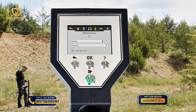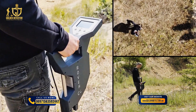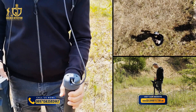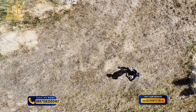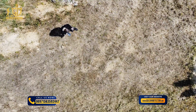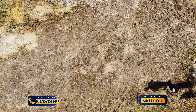After selecting the four parameters, go to the starting point of your first scan line and press Start as soon as you start walking. Scan the first line to its end and press the Start/Stop button to set the field length and number of impulses. Remain at the end of the line and turn 180 degrees around your own axis. Rotate the probe so that the arrow is pointing in the same direction as in the first line. Take one step to the right and start the next line — press Start as soon as you start walking and scan the complete line; this time don't press Stop. Now turn around, rotate the detector, take a step to the left, and scan the next line. Make sure the arrow on the probe is always pointing in the same direction as in your first line. Repeat this until you have completed your scan field.